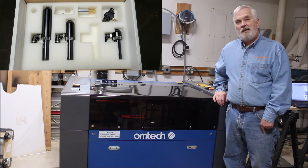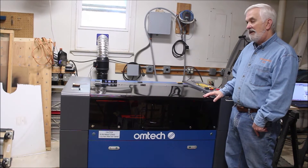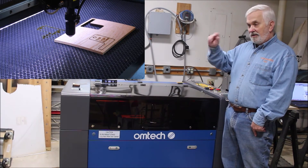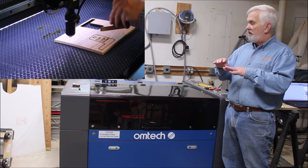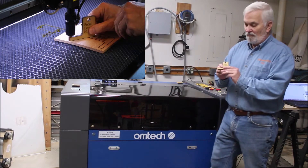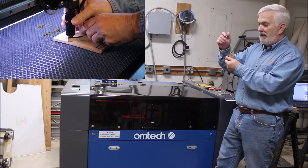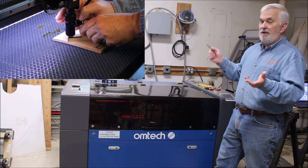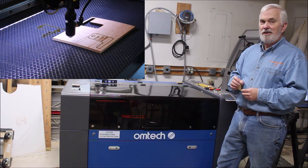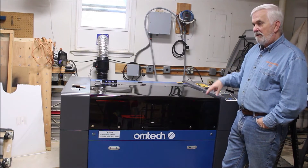I also decided to go with the four-piece lens kit from American Photonics. They seem to be a much simpler way to use a CO2 laser like this. All of their different focal length settings are preset, so when you put the tube in, you snug it up, put your work piece in, bring your table up till it's almost touching, and use a AAA battery as a spacer. Then loosen it back down, drop the nozzle till it touches, and tighten it back up — and you're good to go no matter what lens you have in there. The kit has a one and a half inch, two inch, two and a half inch, and four inch lens. It's just so much easier to set the focus using their system compared to the stock lens.